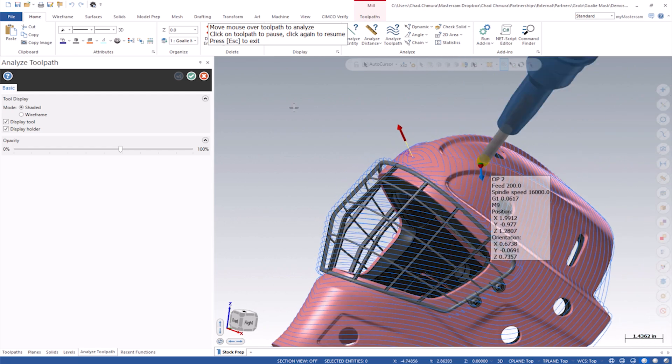If I analyze this toolpath, you'll see the motion is much more uniform — we're just using the Z-axis, using the tool's axis to approach and retract from that part geometry. Because I created some geometry where it goes over the face mask, we're able to get this whole part in one single toolpath. Of course the step-over here is a little bigger than what we used in the real world, but essentially this thing is going to work perfectly. Meshes are really cool — Mastercam has so many great tools that make mesh a really viable way to make real parts.